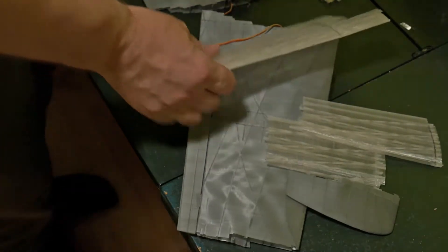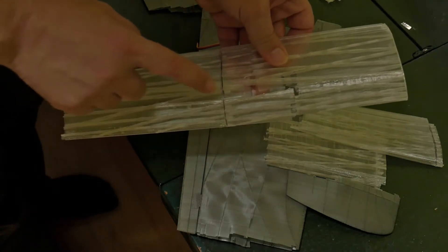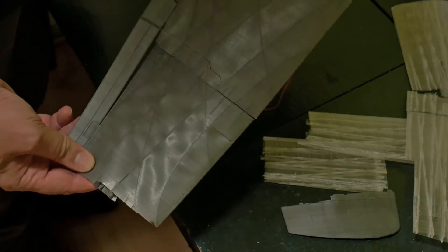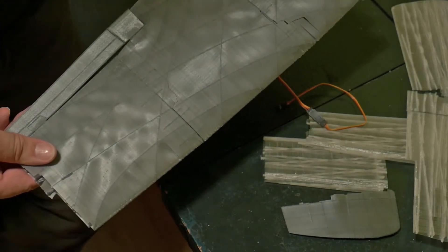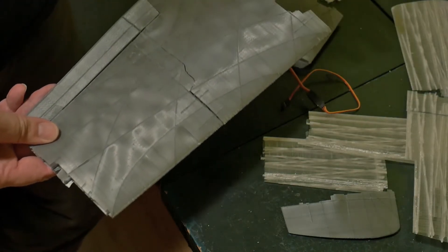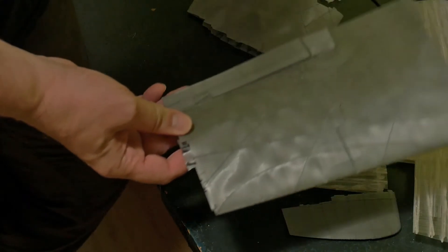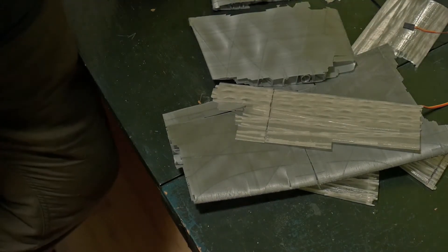You can see the line of breaking is really beside the joining of parts together. You don't need to worry about the strength of gluing with Cyanoacrylate glue on PLA 3D printed airplanes. On this wing — which was my very first 3D printed airplane ever — I made the mistake of not cleaning the rest of glue from the hotbed, but still you can see the strength of the bond is really enough.